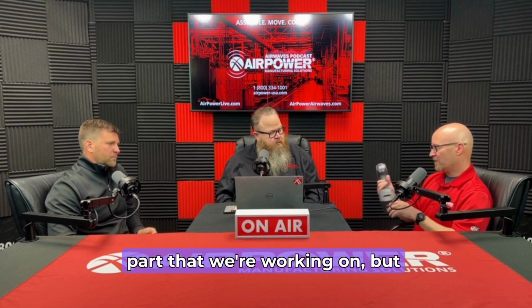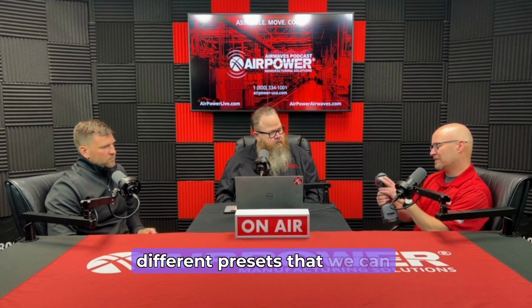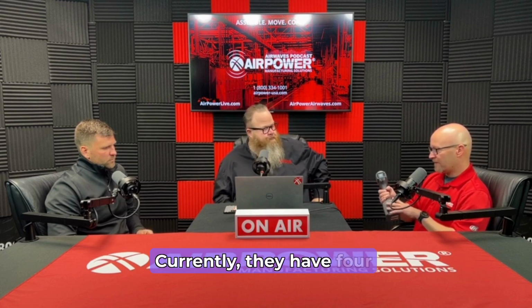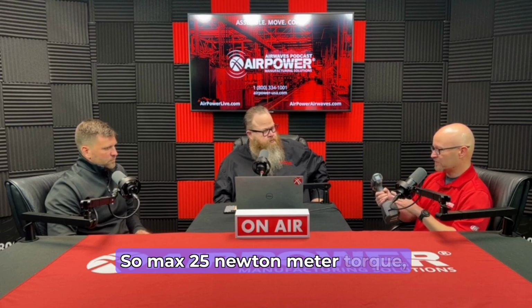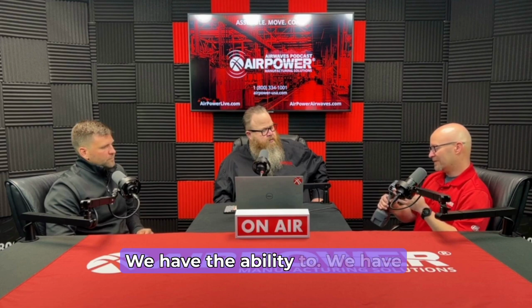working on. But for the tool, we have 8 different presets that we can program to address each individual application. Currently, they have 4 models that they're looking at. So max 25 newton meter torque, 60, 140, and 225. So we have the ability to address a few different types of joints when we're trying to fasten those joints together.